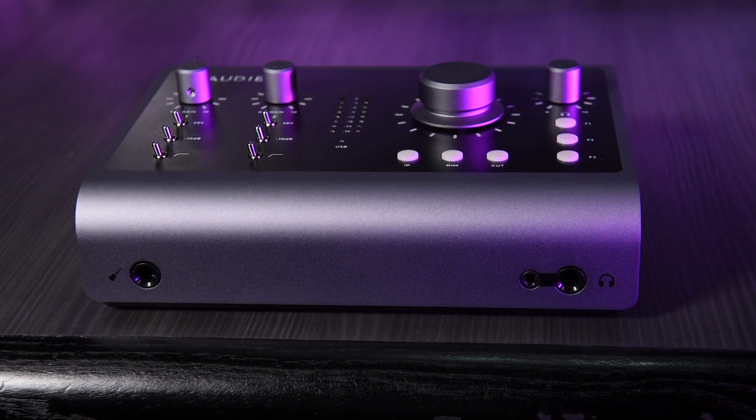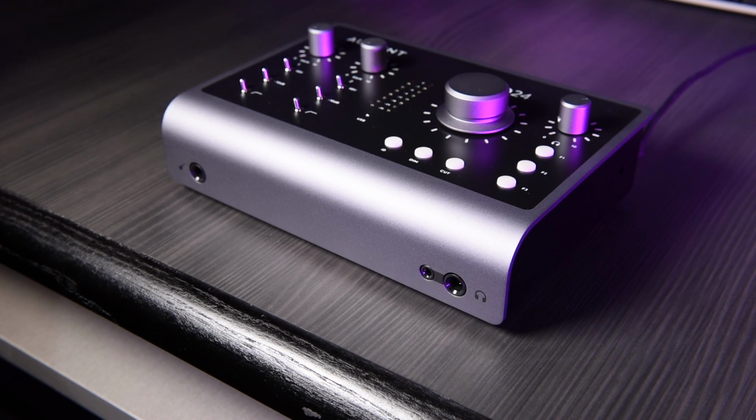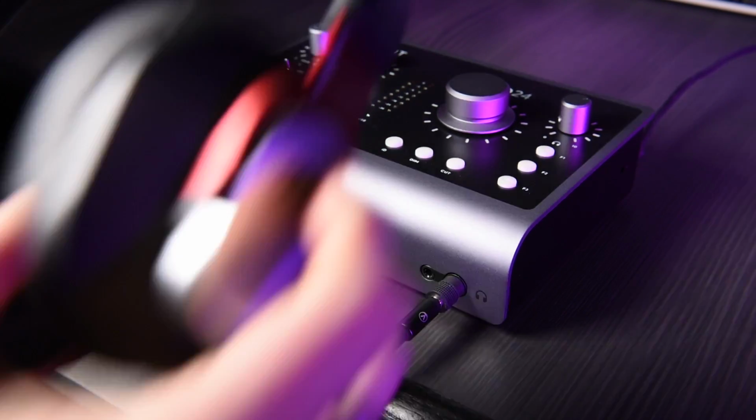I feel the Scarlett is still held back by a weak headphone amplifier, although credit where it's due, it does sound much better. It just isn't loud enough still for me, in my opinion. I think a monitor mute button and an input to DAW blend dial, as previously discussed, would have been nice additions to this range, and it would be nice if the loopback channels were labelled as such and not just inputs 3 and 4. The limitations in monitoring control on the Scarlett for me gives wings to the Audient iD series, which have virtual channels for more advanced monitor mixing, not to mention a second headphone output, which is really useful. Maybe Focusrite missed a trick there as well.